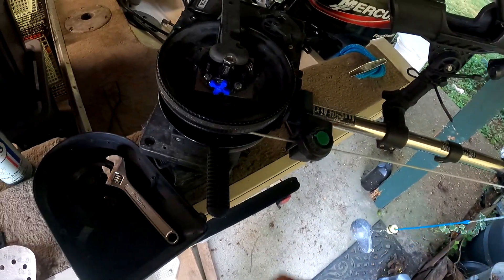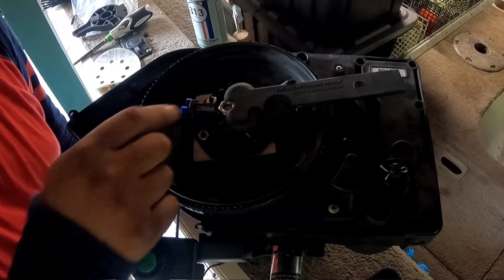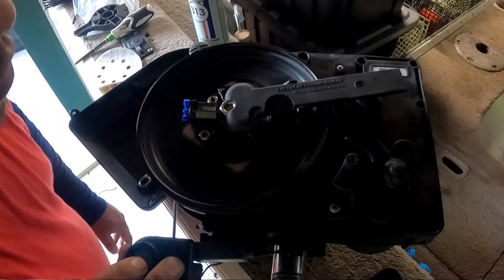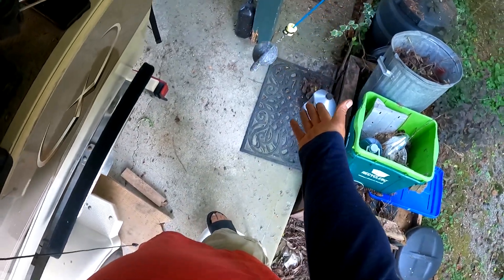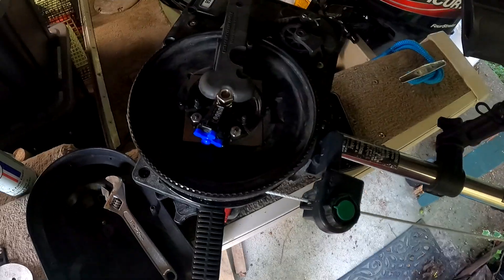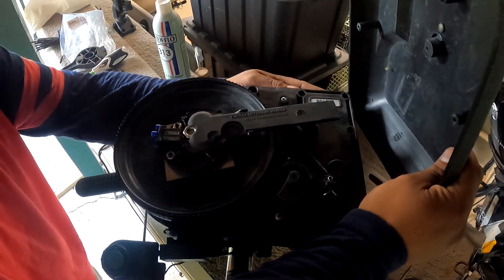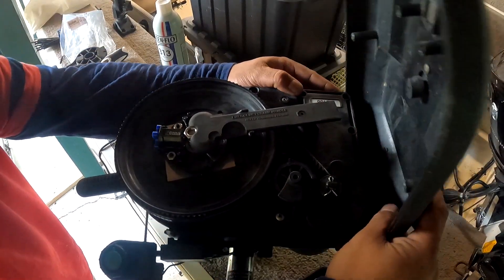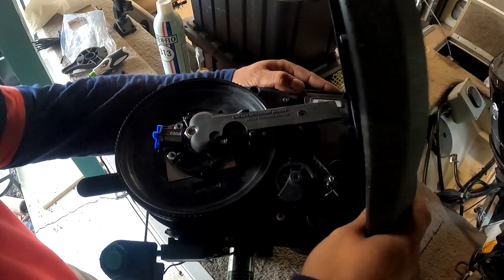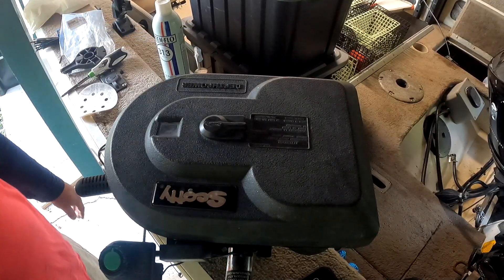Let's try it again. It's holding our unit — very good. It's a little bit tight but not overly tight, and that's going to be our starting point. We'll do a little bit of micro-adjustment out on the ocean. If you're happy with that, go ahead and also adjust your zero counter. Right now it's saying zero, and my ball is about two feet from my gunnel, which is about where the water line is — that's how I like to set my zeros. Go ahead and put this cowling back on: put one side in first, then pry it over to the other side, close the lid, and close that latch. Now you're ready to go.